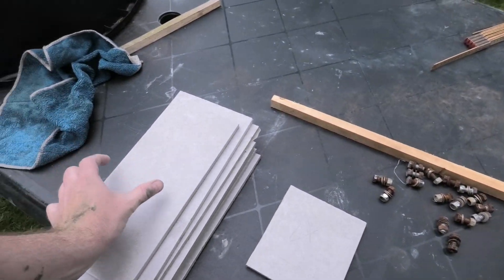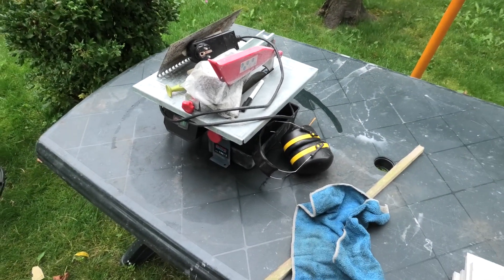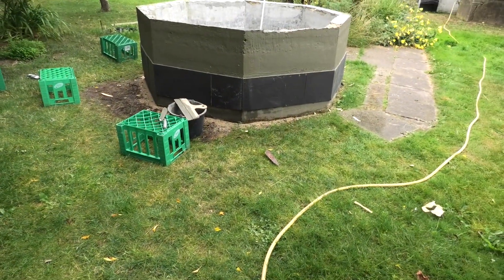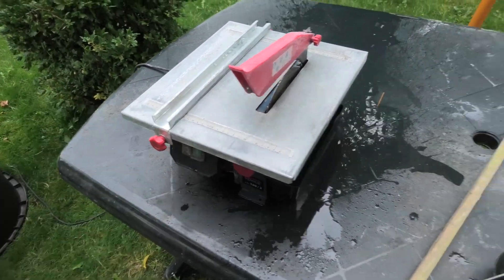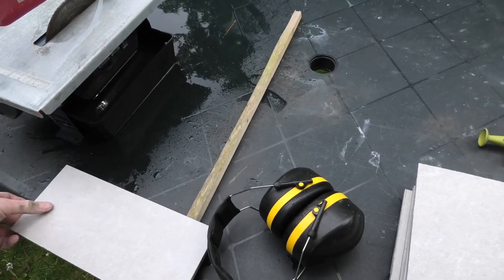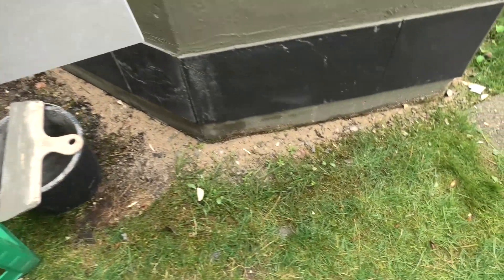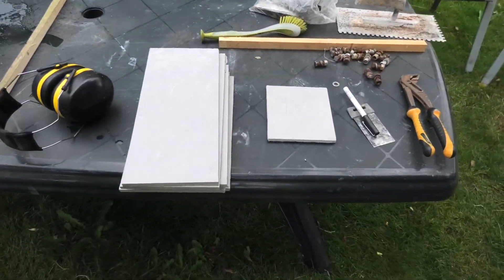Underneath this magical bucket here I have a tiling cutter. We are going to use that. It is very noisy and it is Sunday morning, so I am going to be very popular with the neighbors. But it is church time — they should really be there, shouldn't they? I have set up the tiling cutter with a stop set to 12 centimeters, so I should just be able to take the tiles and find the fabricated side — that would be good to have facing out — then cut that thing off. I'll have a 12-centimeter piece I can glue on my thing over here. This is almost right — it's going to look something like that, and then a dark tile on top of that. I am going to be doing a lot of tiles.